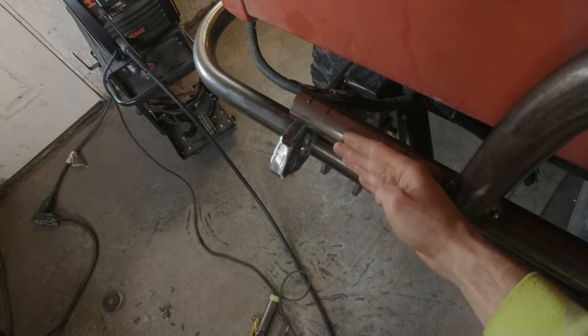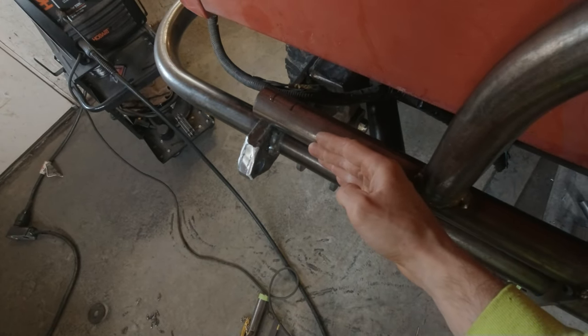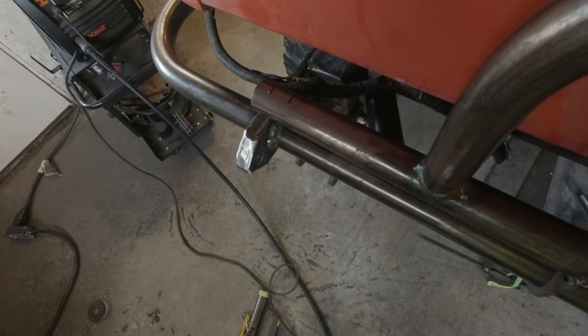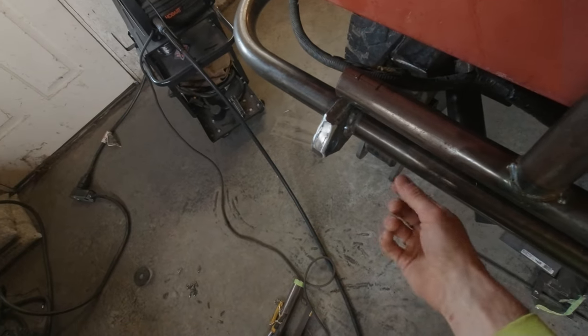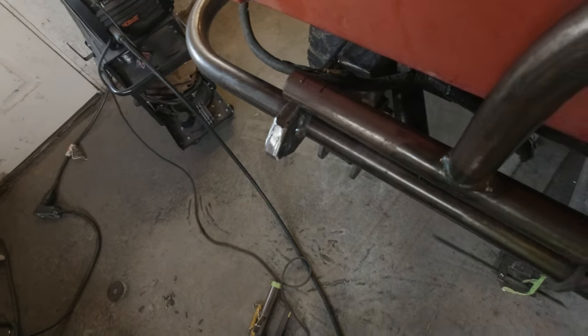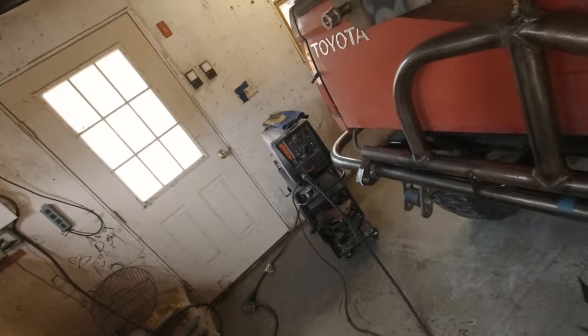in it. And then I'm going to cut a notch in this swing out. Set it back so that the face of the piece of steel I'm going to make and drill and tap is flush with the back end of this tube. So we'll see how that goes. Then I'm hoping I can bolt the latch right on, weld the hook on here, get it dialed in. So, time for some hand machining. Not my favorite thing to do, but let's see if I can pull it off.